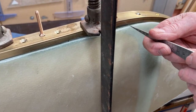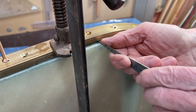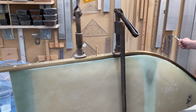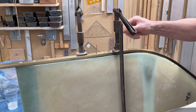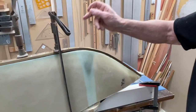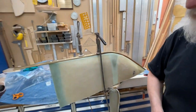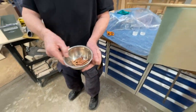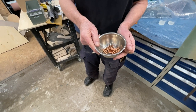There's a depth score — if I put it in here, just three millimeters. I'll fill that up with epoxy and these screws. I drill the holes, fill them with epoxy, clean them with acetone, and drill them a little bit smaller.